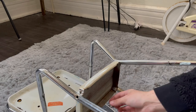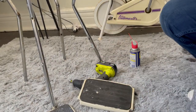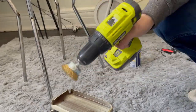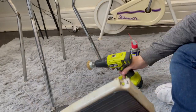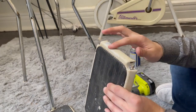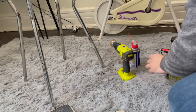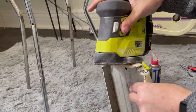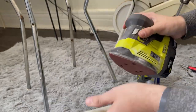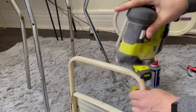The chair — you're going to see a little later how it latches — but the top of the chair basically just latches with little flaps of metal that you have to undo. So I just undid the flaps and pulled the seat off. Here you can see there was paint that had gotten on it at some point. I needed the paint off so it would be a smoother finish when I was done. I started out using a wire brush, and that worked okay, but it didn't take enough off at a time to smooth everything out — it kind of just left strokes.